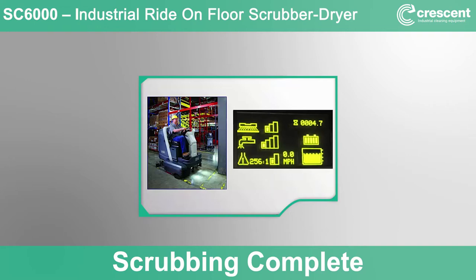The battery indicator icon is like a fuel gauge — when fully charged, all bars will show, and as you deplete the battery, fewer bars will show. Eventually, the battery voltage will hit the machine's low voltage cutoff, causing the display screen to change and the scrubbing system to automatically turn off and raise. However, the vacuum and propulsion system will remain active to allow you to dry the floor and transport back to the dumping and charging location.